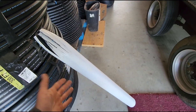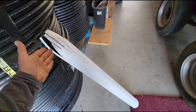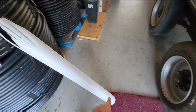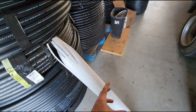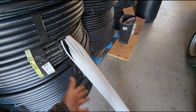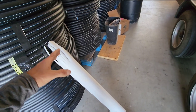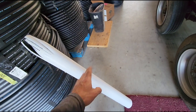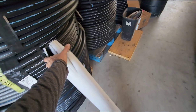There are multiple different versions of this. Some people use a solid piece of four inch with slots in it, using a butt cap for the end and a four inch well seal. That basically just makes the pump weigh 60 pounds instead of 30 pounds, so it's a whole lot more difficult to do with a screen style. There's also a benefit to this style versus the slotted screen style, which I'll explain in a second.